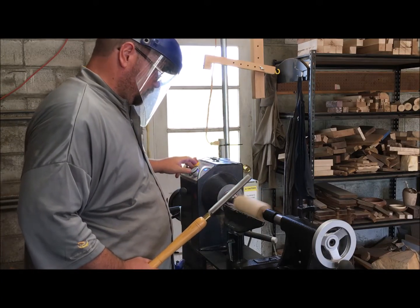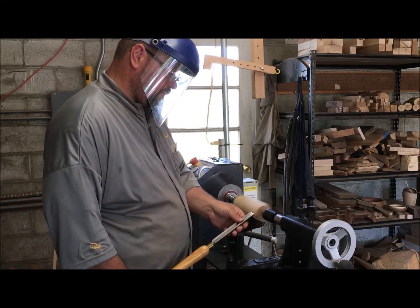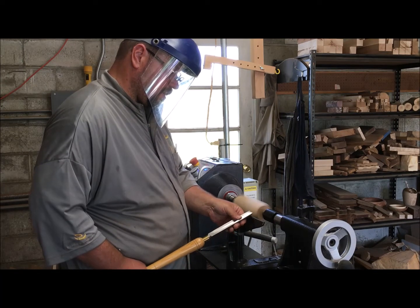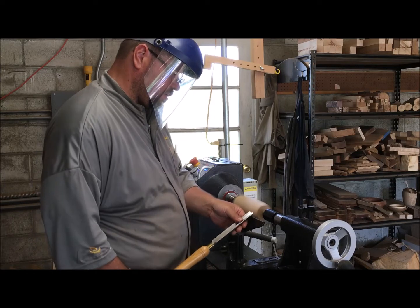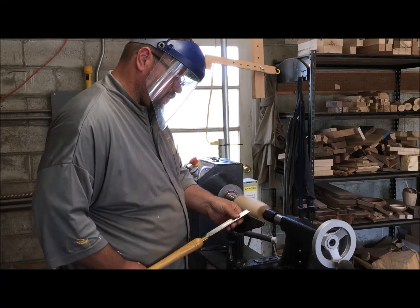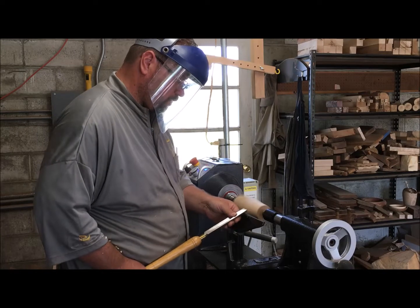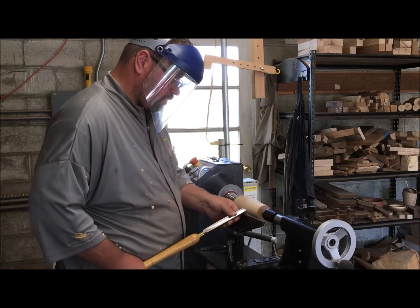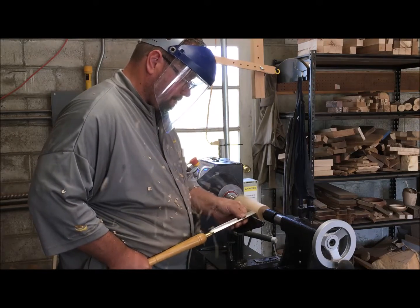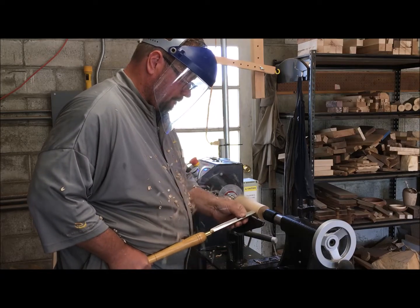In the last video we talked about how to safely turn on your lathe, and now we're going to practice our ABCs: anchored on the tool rest, rest the bevel on the wood, raise the handle until we get the cut, then move across the piece — always working from uphill to downhill, or the highest point to the lowest point. The idea is to take just a little bit off at a time in a series of passes. I always say you don't want to eat an entire pizza in one bite — same thing with woodturning. You don't want to take it all in one pass or it's going to be disastrous.